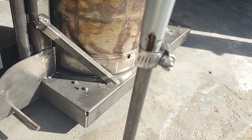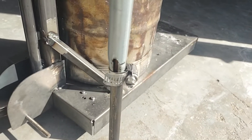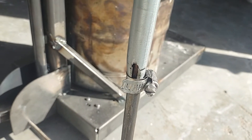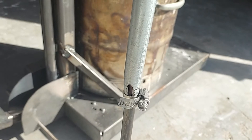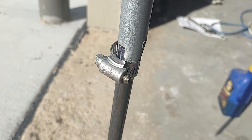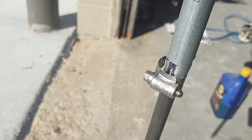It's a piece of half-inch conduit. I notched it — pretty hard, because the thermocouple is significantly narrower than a half-inch, so you need to give the conduit quite a bit of room to squeeze down. You can see how I got that all notched in there, and then a hose clamp to hold it tight.